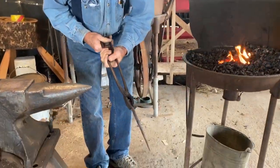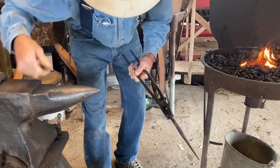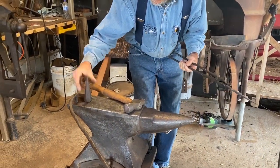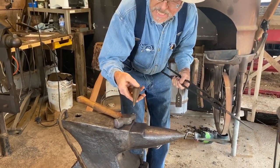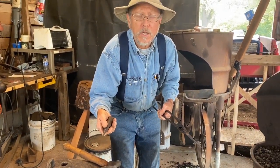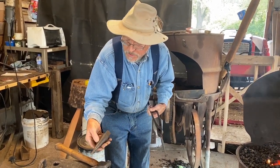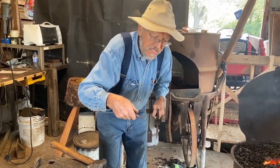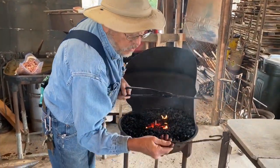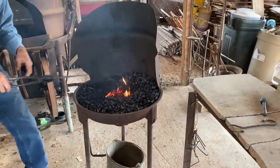It's got a pretty good taper. If I wanted to make it really nice and smooth, I'd use this little cone mandrel I made and do quite a bit of file work — draw filing and addressing the tapered shape. In this case I don't necessarily need that. For a decorative piece like this, you kind of want to have some hammer strikes that show it's handmade.